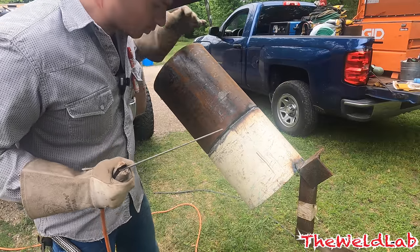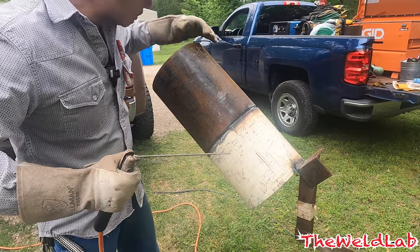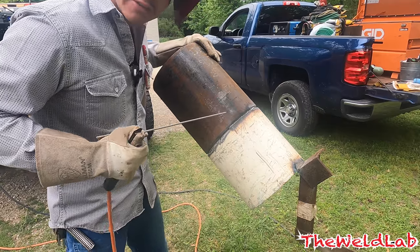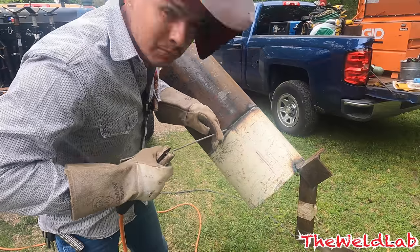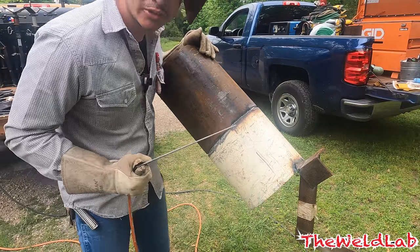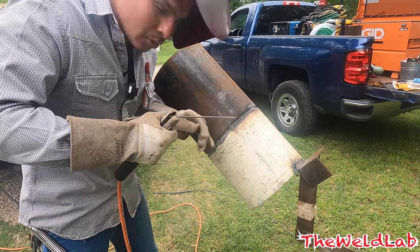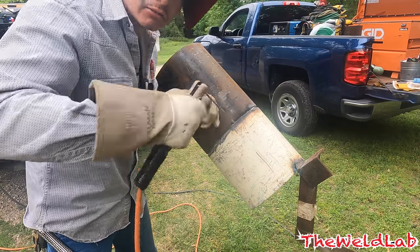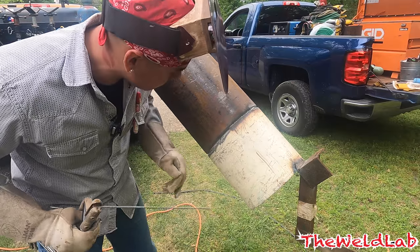When I'm doing my root it feels a little wobbly leaning on it, but once you're stabbing in you want to hold it by the neck - this rod is your sword. You start right here and just keep digging in there, shoving that sword in. Have it angled catching both sides - don't have it too straight up and don't have it too far down, because going too low won't spread the puddle and give you a bigger keyhole.